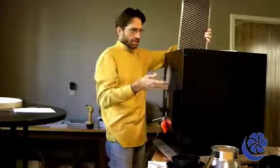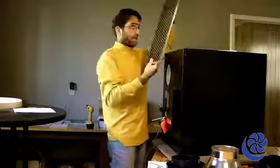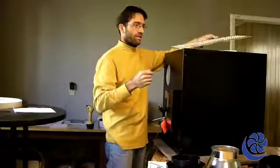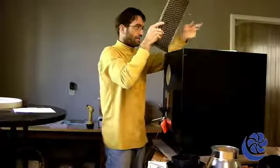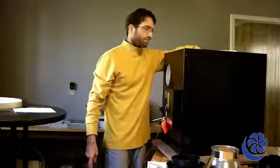And again, the unit can be mounted in all different orientations, so the filter might be sliding out this way, or it might be falling down on you, that's fine. It can be mounted in any orientation that you wish, but you must have 24 inches from this surface to get these filters out and to access the routine service of the heat exchange material.